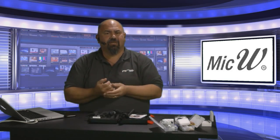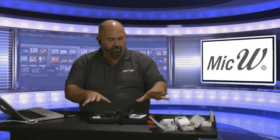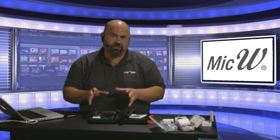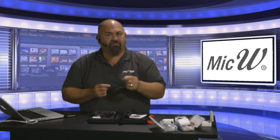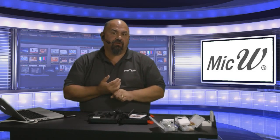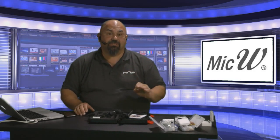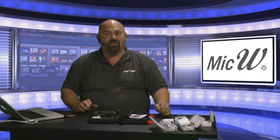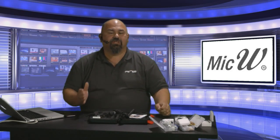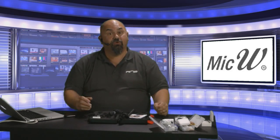Again, as was mentioned earlier, they're much, much thinner and a lot more sensitive. With the style of microphone I've been discussing, the Mic W, which is much smaller, it's harder for moisture to get in there and cause you any problems. But equally, don't leave it in extremes of temperature. All of our products have been tested. You can use them down to really, really low temperatures, particularly the Class 2 reference, because we know it's going to be used outdoors. But it's not recommended to leave it there beyond your normal use.